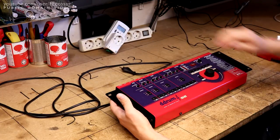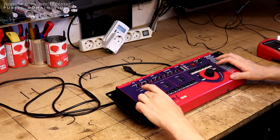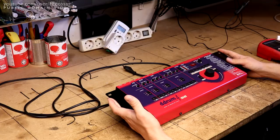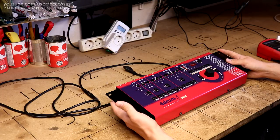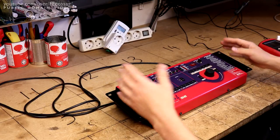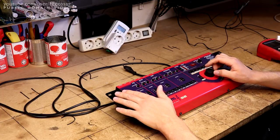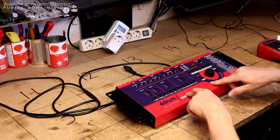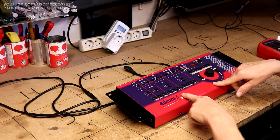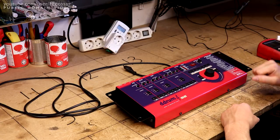So what we're going to do is take this thing apart, and I know it's got some socketed processors, and this thing gets thrown around a lot. It's actually a surprisingly good nick, despite that fact. It often gets stored in barns and dusty places, and it sees a lot of use on the cruise ships going to the island I live on as well. So it sees a fair amount of salty air, making it an excellent victim for corrosion. And I'm rather willing to bet that if we just solder those socketed processors in, this thing is never going to see the issue again. So let's just get it apart.